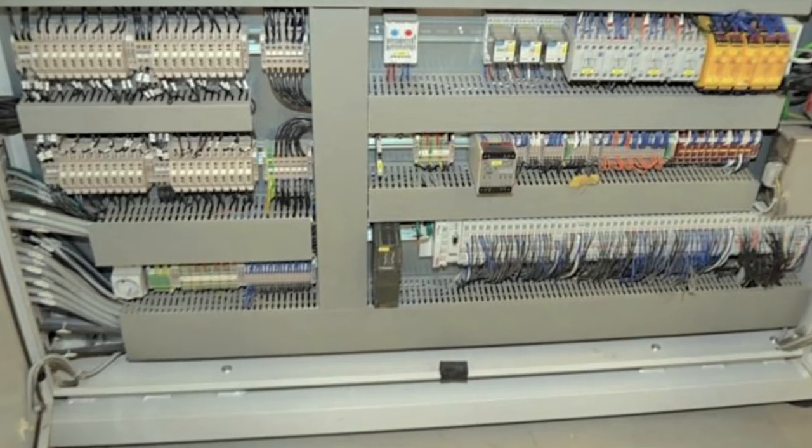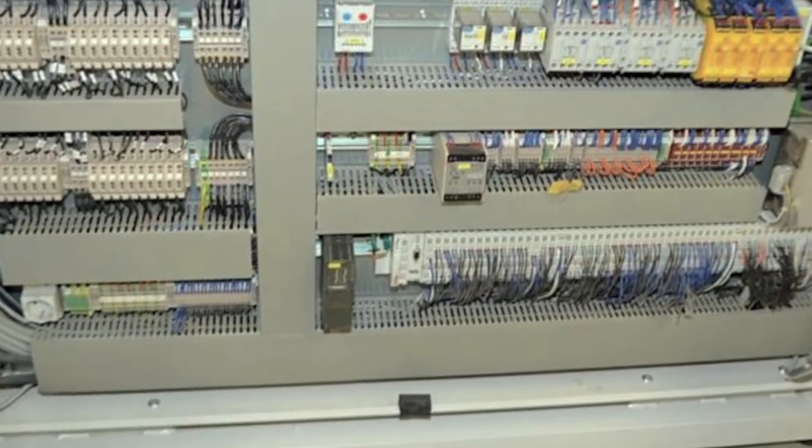I worked for several years at a company that designed and built industrial control enclosures, and some of those jobs I worked for European companies doing subcontracted manufacturing in America. Their standards — the most annoying was a Swedish company using German standards — the wire had a particular kind of label wrapped around it, they specified certain pins, every single wire had to be pinned going into the terminal block, with a particular curvature and the label rotated a specific way. It made serviceability very nice but manufacturing a big pain. But they avoid all the bimetallic cold and hot creep problems, because the ferrules keep the strands from fraying.